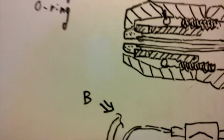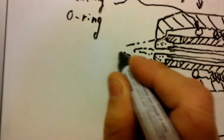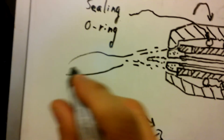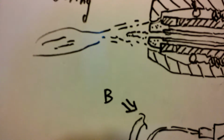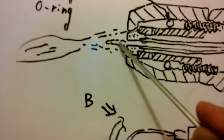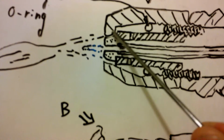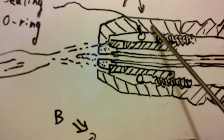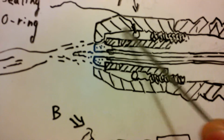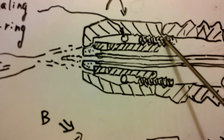And you can see here the liquid going out, and gas is spraying out here. So this liquid will be atomized here and become a mixed coolant, because the high air pressure here will atomize the liquid. And the width of the opening of this tiny gap can be adjusted by rotating this outer brass body; rotate it, then it will move backward and this gap will be less. And there is an inner flat here, engaged on these aluminum pieces.